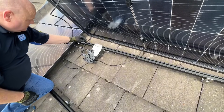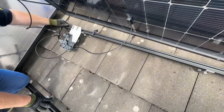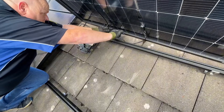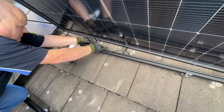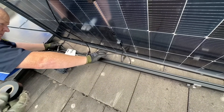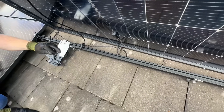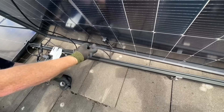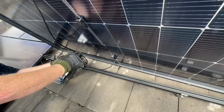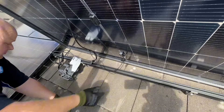Push that into the rail, probably to the right-hand side of the micro, just to keep it out of the way. Then get your DC cables — your two cables — and pull them over the top of the inverter. The aim is to keep them off the roof. We'll use one clip and then put some tape on just for a bit of redundancy as well. Push that clip down and it should click together. Just a bit of tape down here to keep it off the roof. It's not so much of an issue, but obviously you don't want cables burning through. On a DC system when these are strung, that could be 400 volts. On this system the worst case is going to be 40 volts. Obviously we still want to make sure it's spot on.